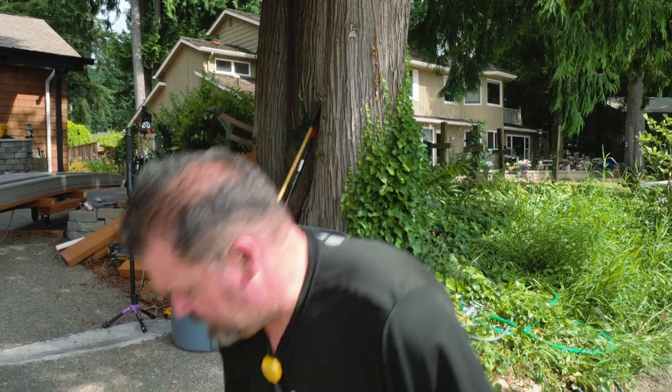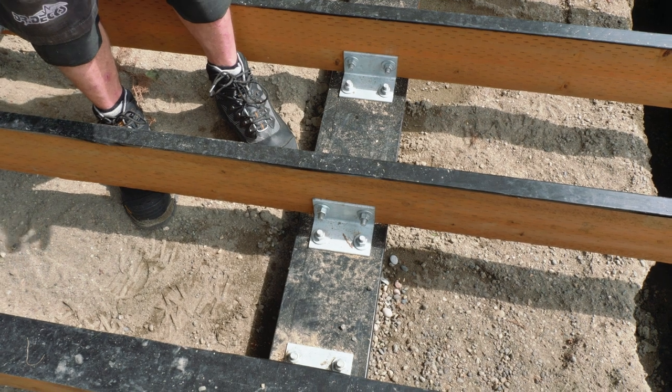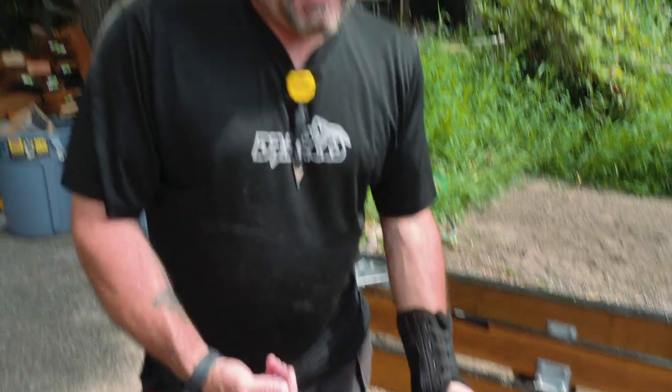We pre-determined all of our elevations — I took a finish gun and finish-nailed all my joists to the proper heights before bolting everything together. Once the heights are figured out you have to adjust the floats a bit, as things can get in the way. Once the ends were done, I clamped all the joists to the proper layout with a 2x8, then went underneath and screwed up from the bottom using 3 to 3.5-inch Fasten Master Guard Dog screws to hold everything in place.